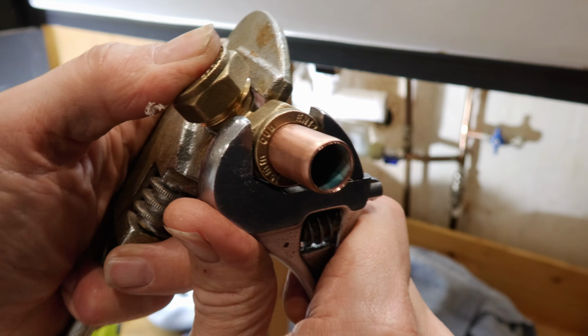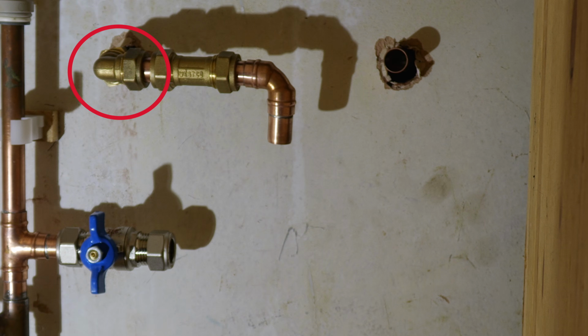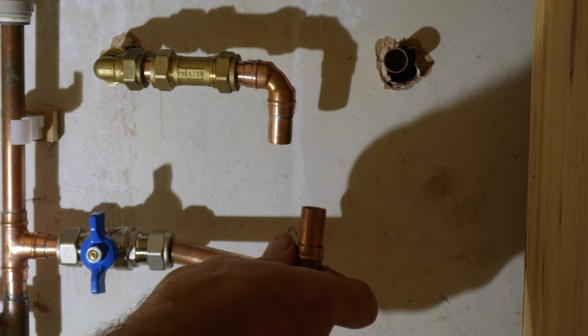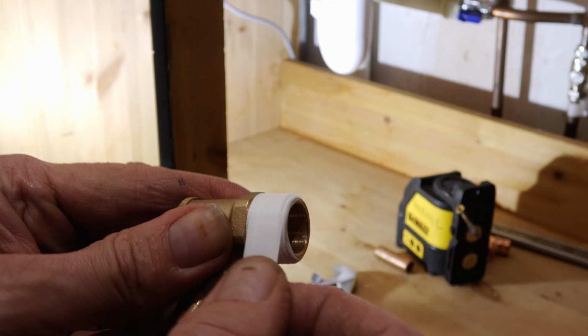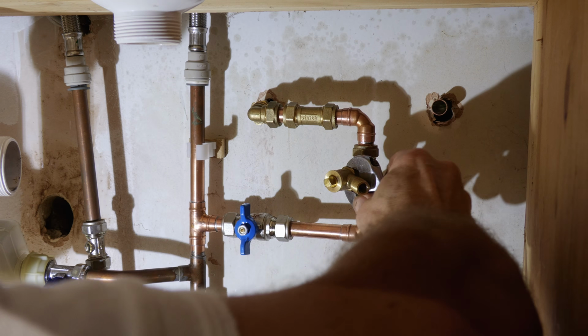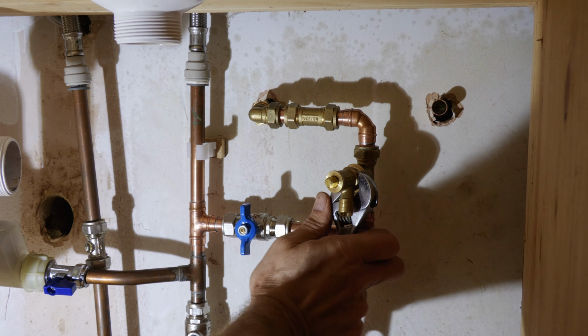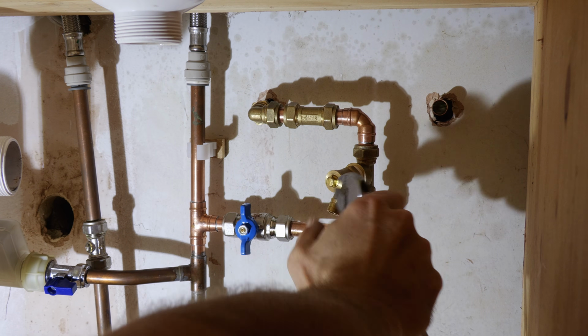Now, a plumber I know, not James, has suggested my assembly is a bit compression joint heavy. Well, I wanted to put a 90-degree compression joint on the tails coming into the cupboard from outside in case I ever needed to remove and relocate them. Also, I'd gladly have used solder joints, but I'm not aware of any solder joints for isolator valves, non-return or double check valves and drain-offs. But let me know in the comments section if I'm wrong about this.